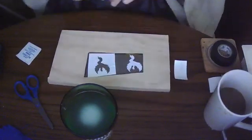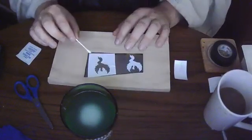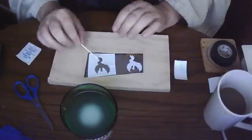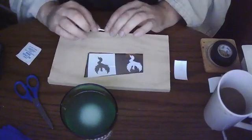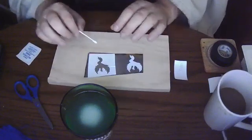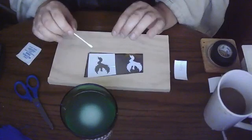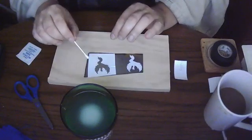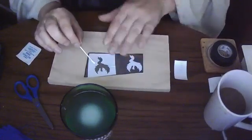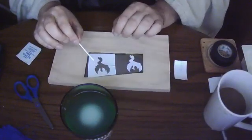Okay. One other point, okay? If you wanted to etch brass or something, instead of the electrical etching that we're going to do here, you can use a mustard etching, okay? The vinegar inside the mustard will actually have a patina effect on the brass, okay? And as long as you're doing it with something like vinyl, so it won't spread and won't get on the part you don't want to do, it will turn out actually very nicely, okay?